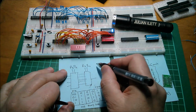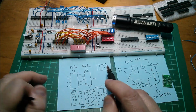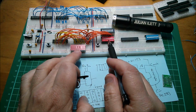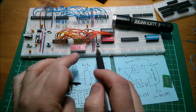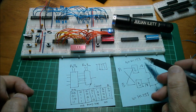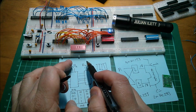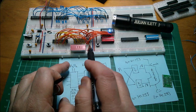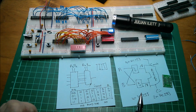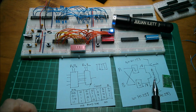You can think of it as banked RAM, where that's bank 0, bank 1, bank 2, and so on. It will jump to another bank. Now, as long as I have the ability to write to that bank, so I'll need bank select switches while I'm programming this thing, I can use either a carry flag or a 0 flag, copy it into this latch, which will directly change the hardware settings on these RAMs, and that will give you your conditional branching. But again, this is early thoughts for this computer.